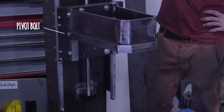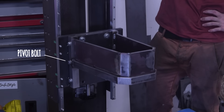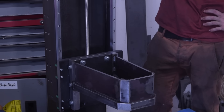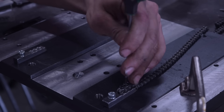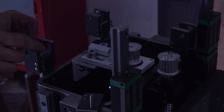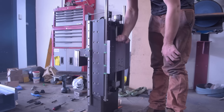Tram in the y-direction is achieved by tilting everything beyond that plate around this bolt. I couldn't resist a test run. This thing is heavy, which means it's time for the counterweight. A chain attaches to the back of the main z-axis plate, then runs up and over the column to the counterweight — you know how a counterweight works, right?